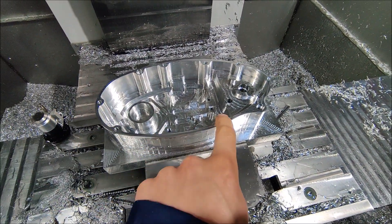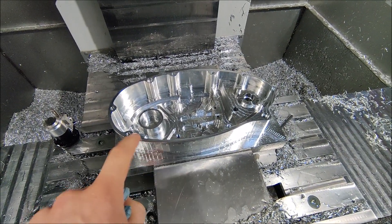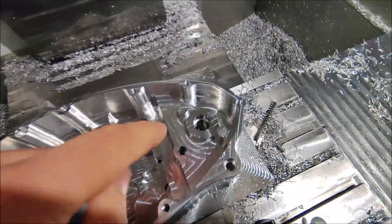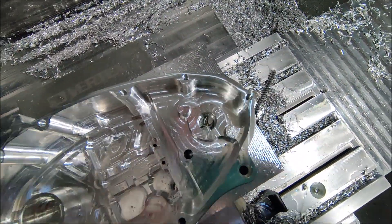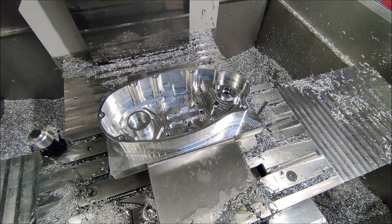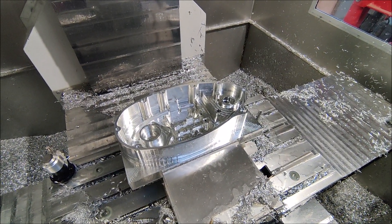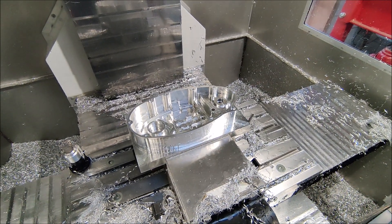Thread cutting the holes - first start a little smaller, don't want to oversize it, but it's just right now. Also made the hole all the way through so I can find the center point for op2. So now I'm gonna get it out, clean it, and then mount it to the fixture plate and then machine the other side.